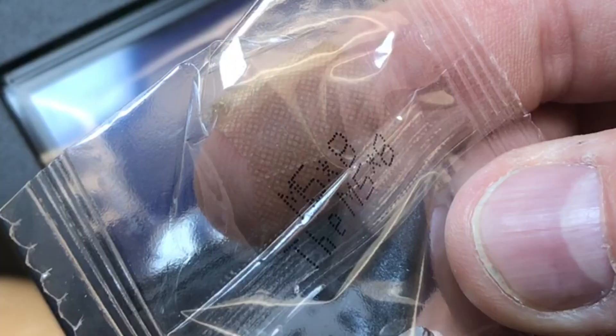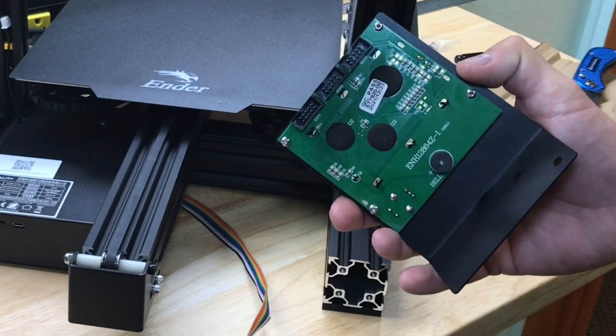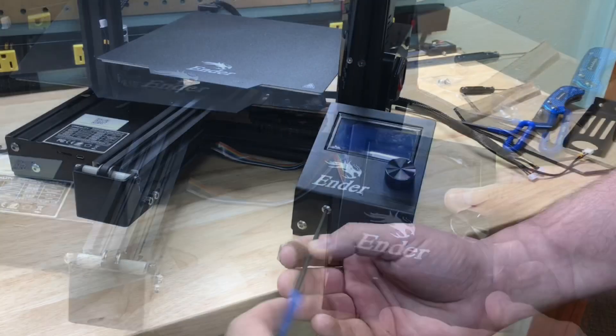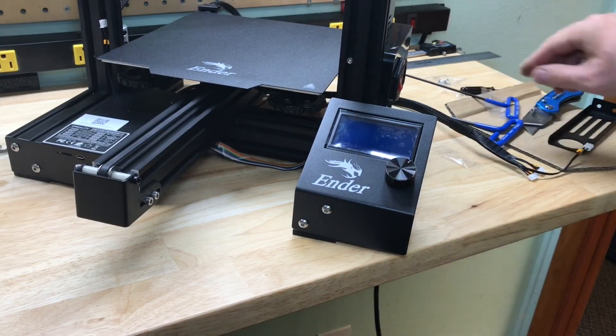Use the M5x8 screws to mount the display. There are just two screws that hold it, but there's an EXP3 connector — make sure the wire goes into there. It's keyed so it only goes in one way. Install it with the two screws, tightening one and then the other until it's tight.